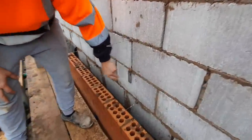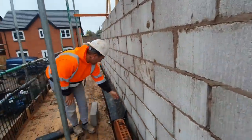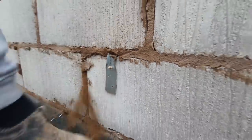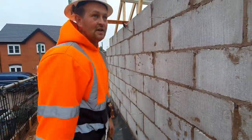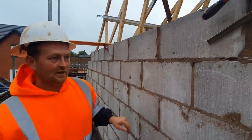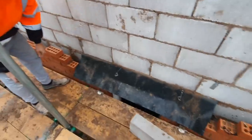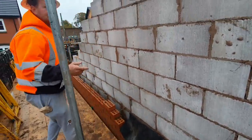These have been pinned with a nail, now bent back down. Yeah, even though it looks a bit short, it's in the line. The joiner looks like it's just got a bit of — this is, and by the way, this is Ozzy's — these couple of courses here, they are Ozzy's first courses. Not too bad, and then I went over the top. You can see because my joints are full. Yeah, actually we incorporated the DPC, ready to go over that, and then that soldiers over the top. I'll do the same on the other side.